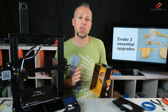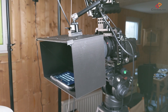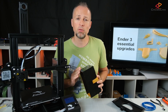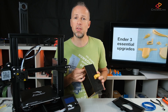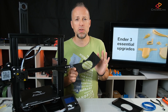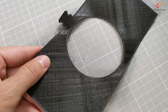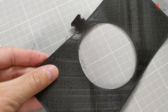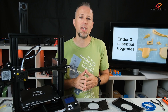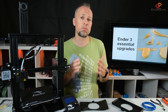Let's begin with a little story about a project that I've recently started — this 3D printed teleprompter. This is a 14-hour print even after several rounds of optimization. My first print on the Anet A8 was successful but I needed to scale up a little bit and switched over to print this on the Ender-3. After one hour of printing the first layers, the PTFE tube inside of the extruder clogged. The top layer is scattered with little drops of filament and it's quite rough, meaning the extruder motor had a very hard time pushing the filament through, which led to this fatal premature end of the print.